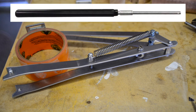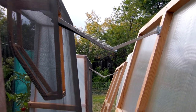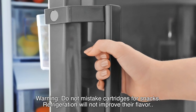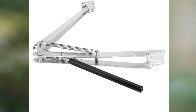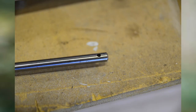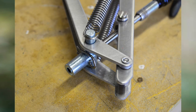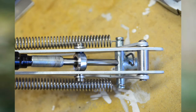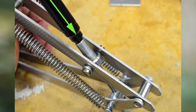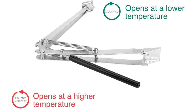With the opener on the workbench, I attached the wax-filled opener cylinder. This cylinder cartridge is what expands and contracts with the temperature changes inside the cold frames and opens and closes the lid. I put the cartridges in the refrigerator for about a half an hour before installing them so they were fully retracted, making installation easier. For mounting the opener in this configuration, the T-fitting is pointed away from the threaded ring. The hole in the shaft of the cylinder will mate with the hole in the T-fitting and a cotter pin is inserted to attach them together — this pin allows for easy removal of the cylinder when needed. With the cotter pin in place, the cylinder is pushed forward to engage the threads with the threaded ring and then screwed in about halfway.